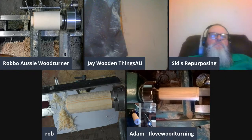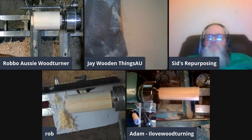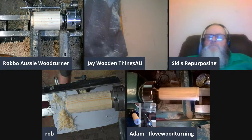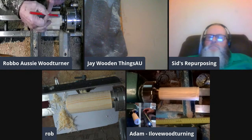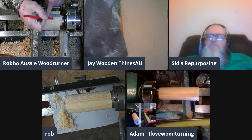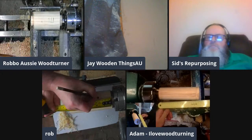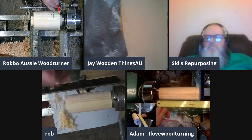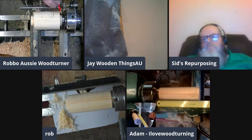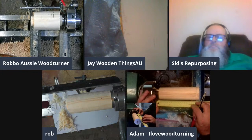That's still big enough, should be. Right. Okay. Ruler and pencil, first off. From the headstock end, where you've got the full diameter, mark 30 millimeters. Is that 30 mils from the jaws or just 30 mils from wherever you want to start? From the round part here. From the front of the jaws, okay. Yeah, not from the chuck or anything.